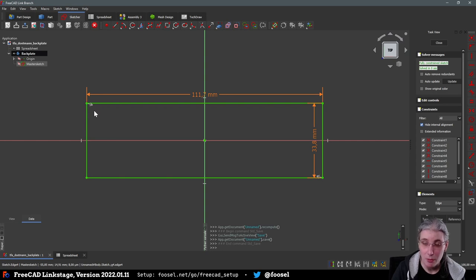Okay, so what I was saying is, first of all, we can either do this with that thing here, create a fillet between two lines, but the downside of that is that it then loses the points which it currently uses for the length constraints here. So that is a bit annoying. The other option is to do it with a fillet in the extruded version. And I'm currently a bit unsure what the best way is here.